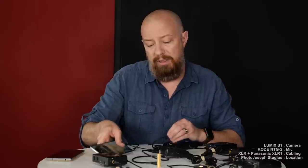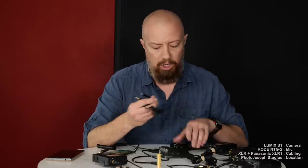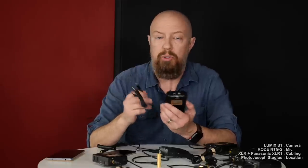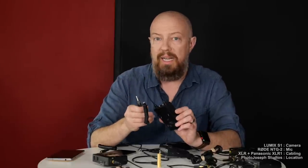However, this cable is actually stereo. On a mic like the Comica, it works just fine because this microphone sends out a mono signal along both the left and right channels, so you get effectively dual mono — great. If you have a stereo receiver that actually receives from two separate microphones, this is fantastic: with your smartphone, you can get channel left and channel right for Mic 1 and Mic 2.